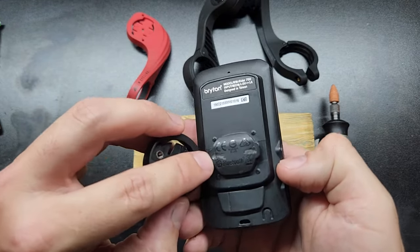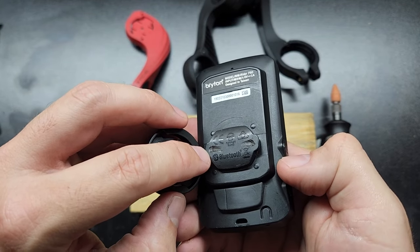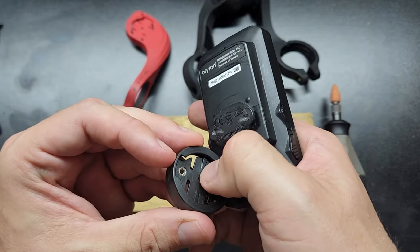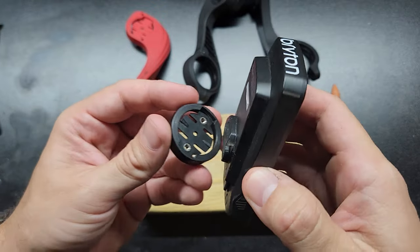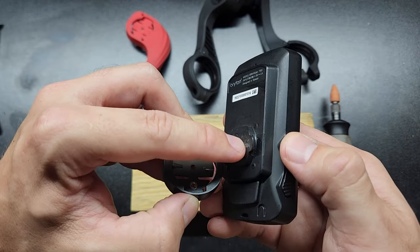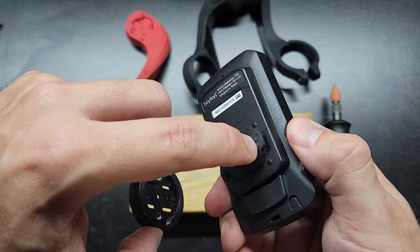What it was is that these little grooves in here — I've modified mine already so they don't look like the original — but these were little angled channels and they weren't going far enough to the outside, so they weren't engaging these stops. Basically these are little click-point kind of stops, and when you put it in and rotate it, these essentially springs are supposed to pop in there. But if these grooves are too shallow, it'll never engage.